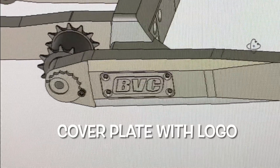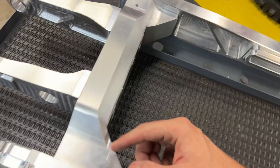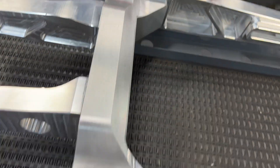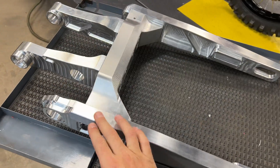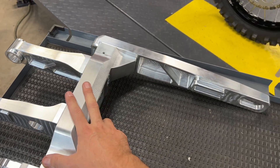Let's go back to the CAD drawing. You guys are going to see a custom name plate on here to cover up the hardware. Again, this is a modular design — we've got this cross piece actually sitting into a pocket. We've also got some bolts holding it together along with four dowel pins, so that's going to hold all the load on the swing arm, keep this thing super strong, and stop any twist.